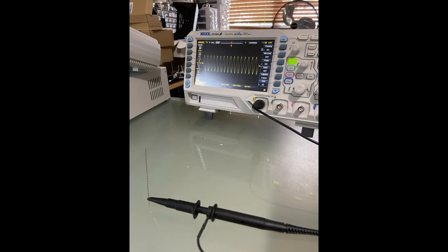Let's go back just a little bit. I skipped over an area for a reason, and I want to go back to it. It has to do with our number one coil. Where do you place the clip on the number one coil? Well, you have to be able to set up a probe next to it to your oscilloscope. Generally, I say about 12 inches away, set it up, you're good to go for testing.